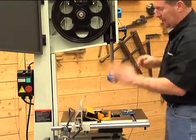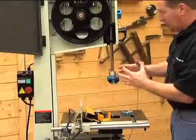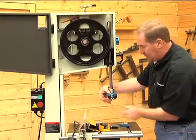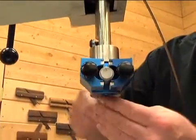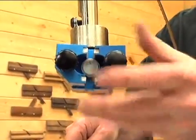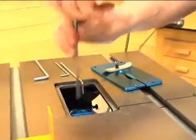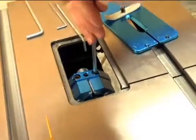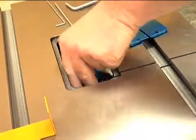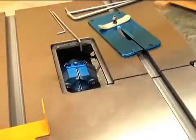Now with these guards removed it gives us full access to the guides. One of the things we want to do to make the bandsaw blade installation smooth and easy is to take the guides and back those off. Simply open up the side guides by loosening them at the bottom and slide them back. Loosen right at the bottom of the center shaft and that thrust bearing will slide back — that takes care of the top ones. Now on the bottoms, simply loosen the side blocks and then loosen the thrust shaft as well. This entire assembly will slide right back, and with that out of the way our blade will go right down the middle.